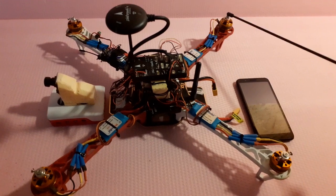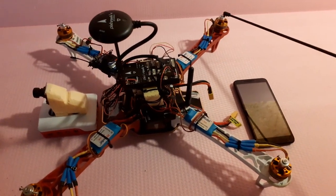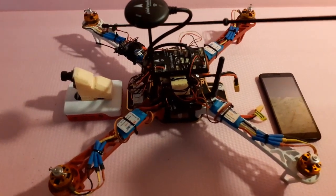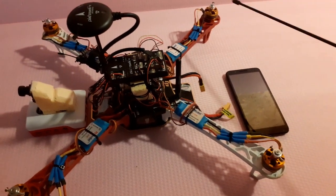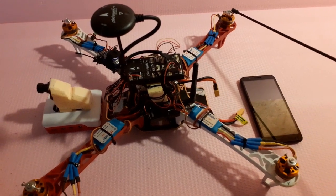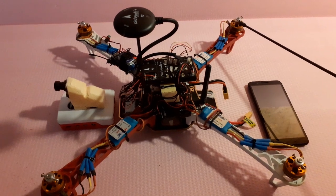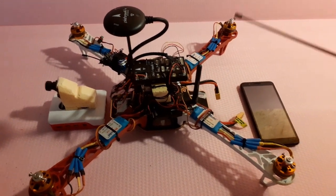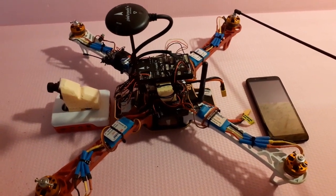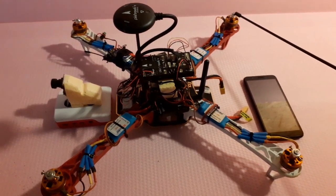So these are the components. You've got these two motors — obviously you should know these motors counter-rotate, so they require different propellers. These two motors spin the same way and these two motors spin the opposite way. The normal prop connections require counter-rotating nuts so that they tighten when the motor's spinning.